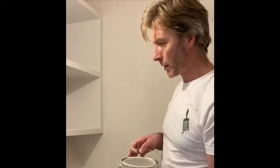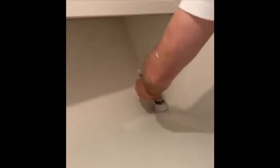One more thing I wanted to show you — I promised I'd show you how to put the paint on with a brush. We put our primer on with a brush and a roller because it didn't really matter what the finished surface was like. Now for my second coat, the top coat, I'm going to show you how to apply paint with a brush. We'll often give clients the option of a roller finish or a brush finish. The secret with a brush finish is you just need to keep moving — keep what we call a wet edge so the paint doesn't start dragging. So I'm going to paint this top bit, which is one of the more challenging things to do — a big open area — whilst keeping a wet edge.